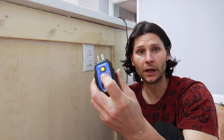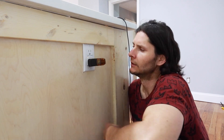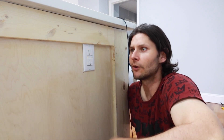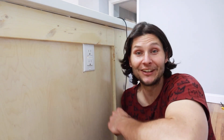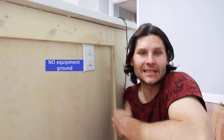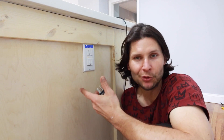I'll press this yellow button — because there is a ground wire on this one, watch: it activates the internals of the GFCI via the ground wire. But the outlet with no ground wire won't activate that way. So if you're selling your house and an inspector says your GFCI outlets aren't working, just explain there's no ground wire. You can buy little stickers that go on the outlet — it's actually code to put stickers on that say 'no ground.' Most people don't put them on because they're not aesthetic, but a proper electrician will.